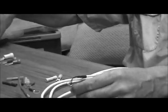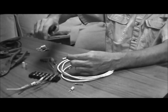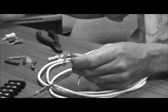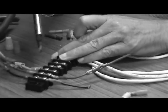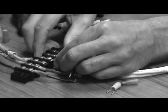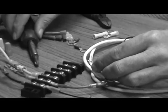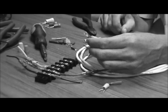What I personally prefer doing, if I absolutely can't remove the screw completely, is take a pair of wire cutters and cut that ring terminal just a bit in the middle. Then when I go to put that on the screw and slide it on there, I have to kind of force it — and you can see it stays locked on there and won't fall off. That's a better alternative if you cannot completely remove the screw, and there are some cases where you have to hook a wire up to a fastener and the screw won't come completely out.